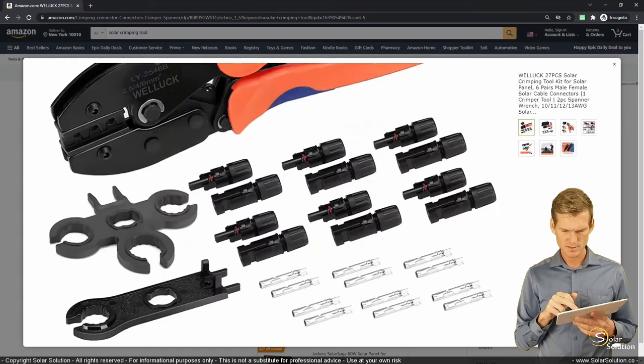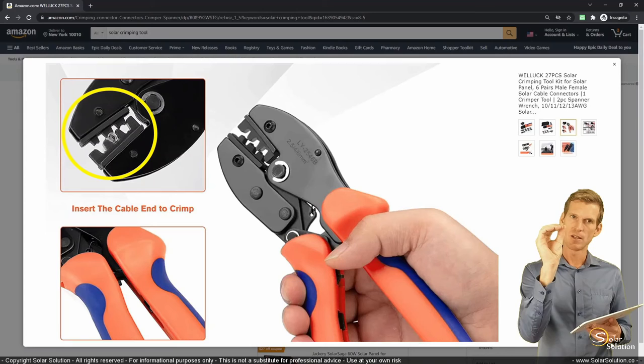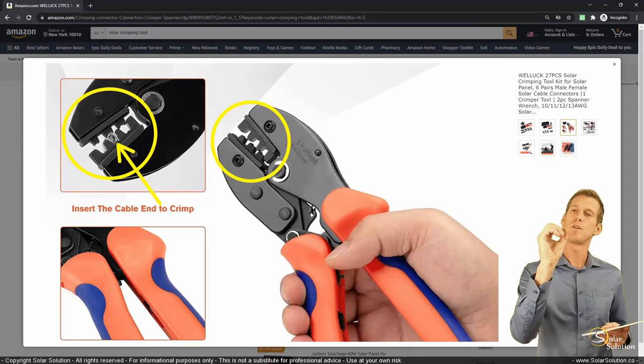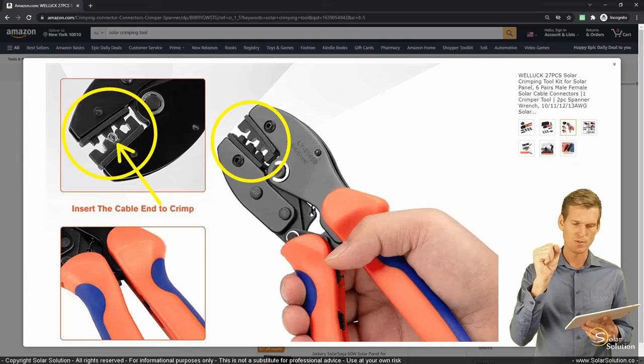The reason I want to show you this is: when connecting the metal part to the wire, please don't use a normal plier. You really want to squeeze it properly around the wire — not just clamp it between the metal bits. I've seen many systems with vague performance complaints where the connection was poorly made, started to corrode over time, and developed more resistance. You can avoid a bad connection by using a proper crimping tool like this.